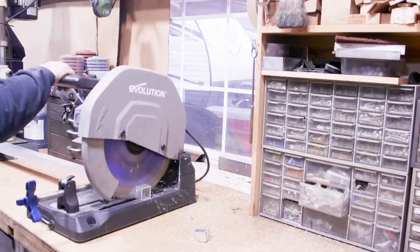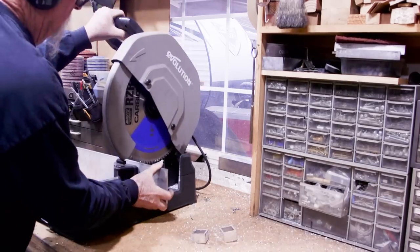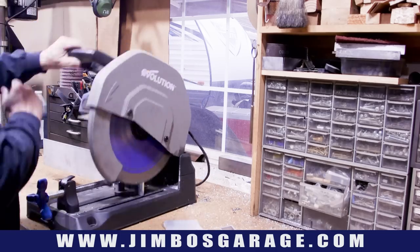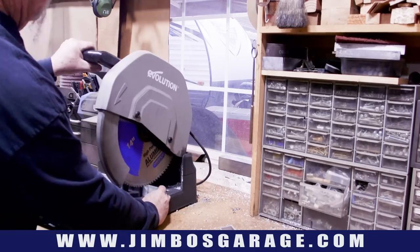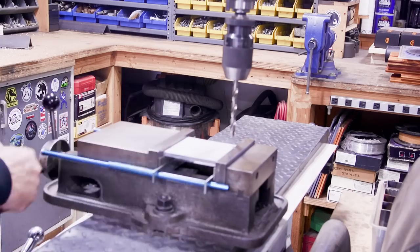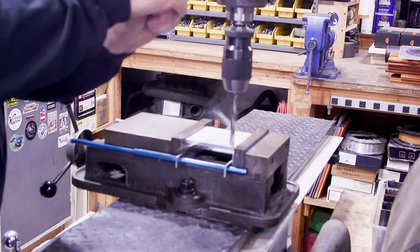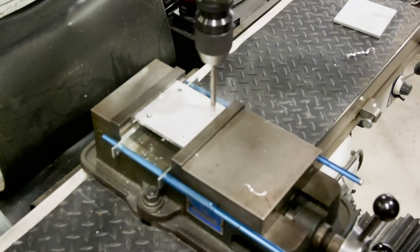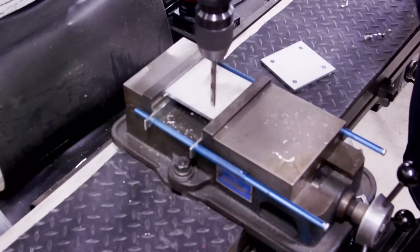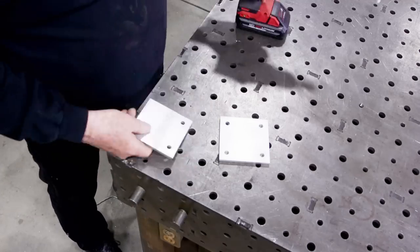Back to square position, cutting at 90 degrees. I'm using quarter-inch by four-inch flat plate for the bases — only need two — and some inch-and-a-half by quarter-inch flat bar for the caps on the tops of the posts. Drilling out the mounting holes: four holes for the freestanding latch post centered on the plate, and two holes for the hinge post that mounts against the house.